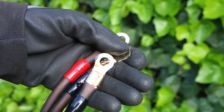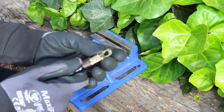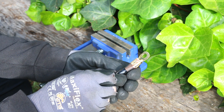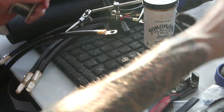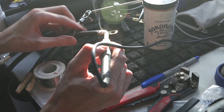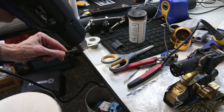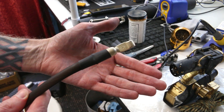These ring terminals are also a bit too wide for the controller, so I have to do a slight modification on all of them to get them to fit. I'm making these cables entirely out of parts I already had laying around from other projects, which is why I have to modify them. I tend to overbuild cables, and that includes soldering, because I loathe an intermittent connection and sometimes crimps just don't work as well as you want. I am trying to make these cables as safe as possible because there is a ton of power going through them.